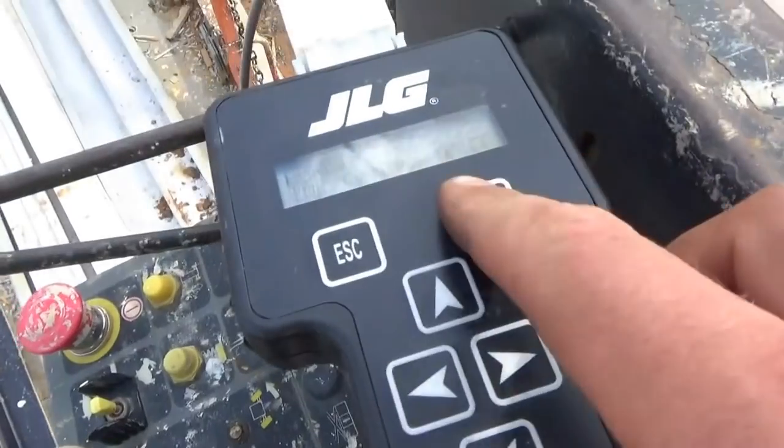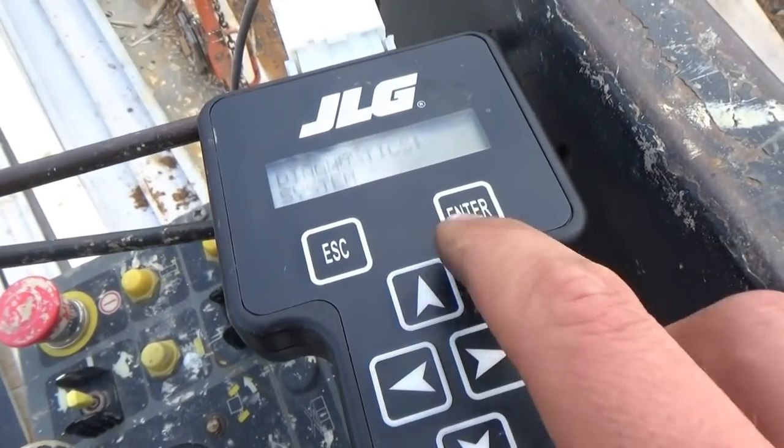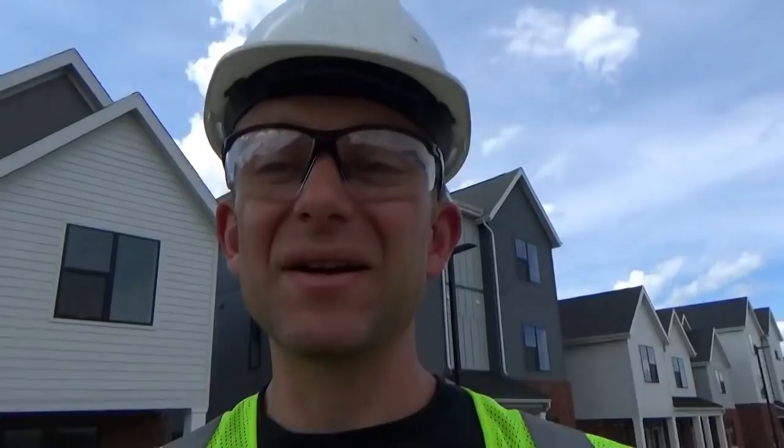So our tilt sensor — system — right there, tilt 0.7. It seems like a lot of the problems are related to the tilt sensor — because it was all out of whack, it couldn't level itself, and then it couldn't go up. Initially I didn't get this on camera, but it said the elevation sensor is always open, so even when the lift was down that magnetic sensor was still open. I'll give it back to them, let them use it — get a new pressure transducer for the right rear leveling jack — but if it works, it works, even if there is a fault stored. Thanks for watching, hope you've had fun on the construction site — stay tuned for more, see you next time, bye bye.